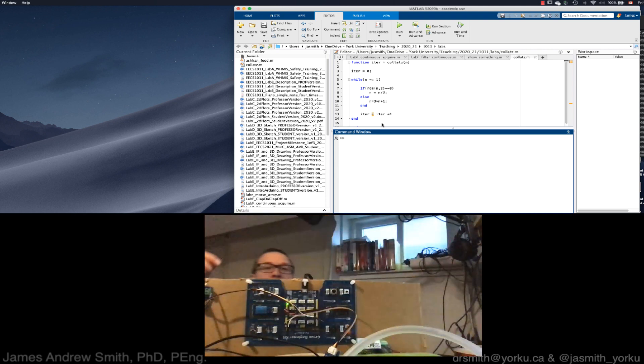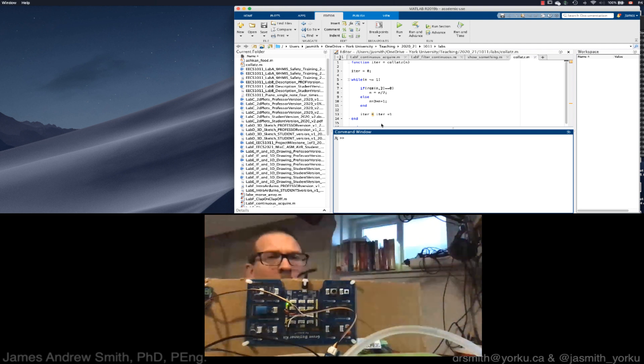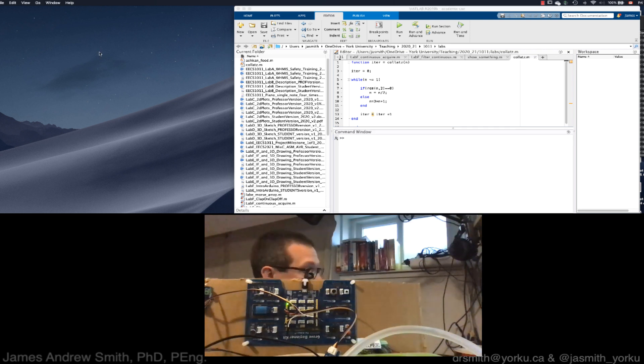There's going to be a power light that will light up to show that it's connected and all good. Once you've got that up and running, make sure you've got a good quality USB cable, because power-only or recharge-only USB cables will not work. There have to be four wires inside the casing — two for power and two for communications. You'll know there are four wires if you get a good quality cable from a well-known source, or if it came with your board.